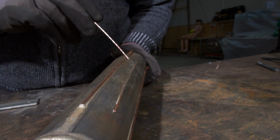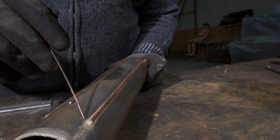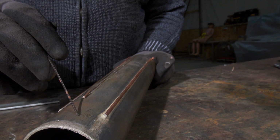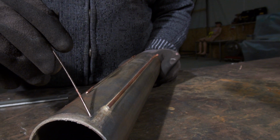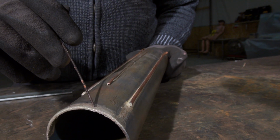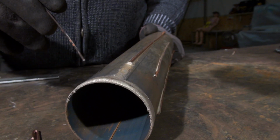So what is evident from all of these three is that some of the silver went downwards. This one was soldered standing upright. So this is the lower end and the other end is the upper end. Gravity seemed to have pulled most of the silver out of the cavity, and a lot of it has stuck down here at the bottom of the test tube.